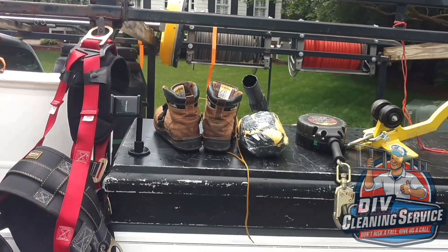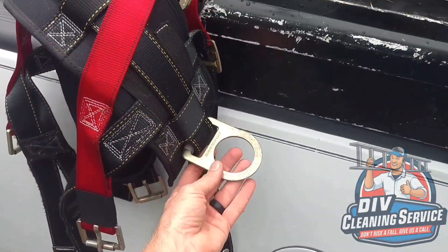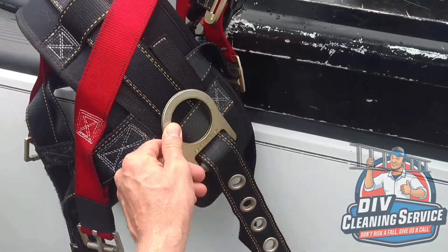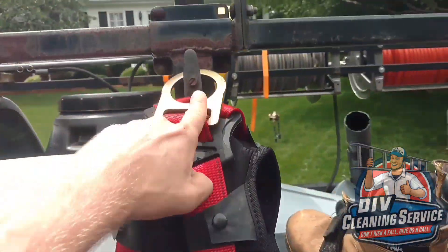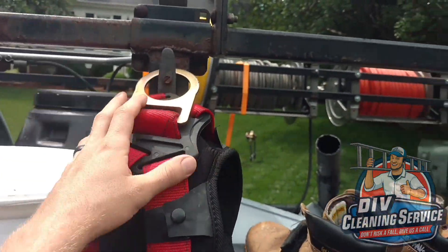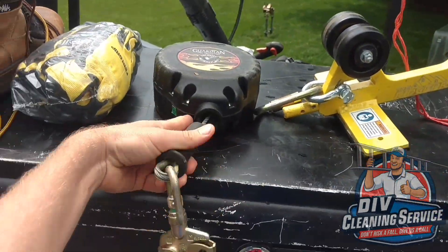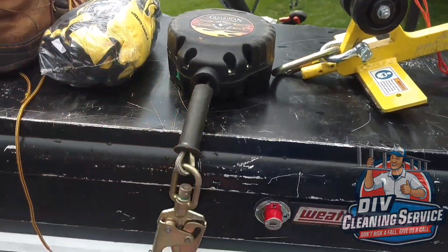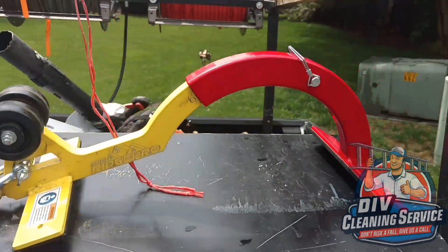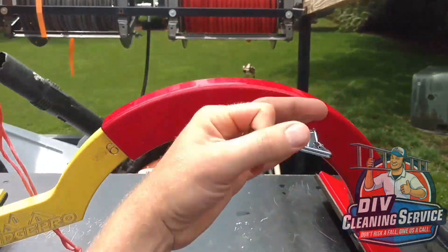Guardian harness — I have a camera mount that I put on different areas and video from. What I like about this harness is the side D-rings. These are meant for tools, but if you need a solid lanyard tie-off point, you can use the side D-rings to adjust the lanyard easily. It's nearly impossible to reach behind your back and adjust it. The lanyard that I'm using today is my go-to — it is a retractable cable one, so I don't have to worry about adjusting it. I just clip it behind my back and go from there.